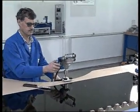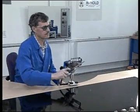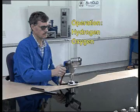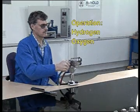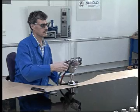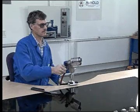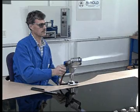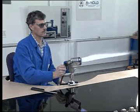To ignite the burner, open the gas valve in the main line and ignite the escaping gas quickly and safely. This burner can only be operated with hydrogen and oxygen. Open the oxygen valve. Turning the gas tap generates the individual flame levels: pinpoint flame, medium flame, and intense flame.